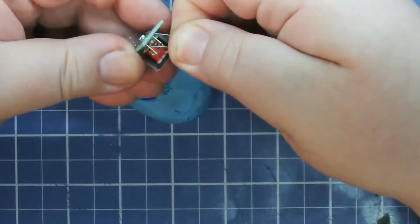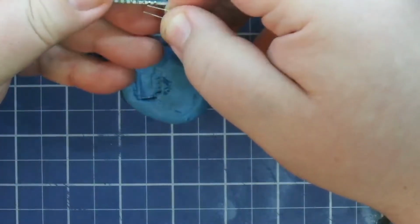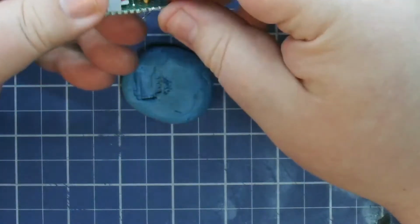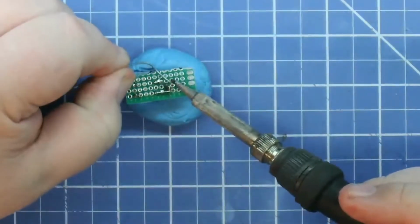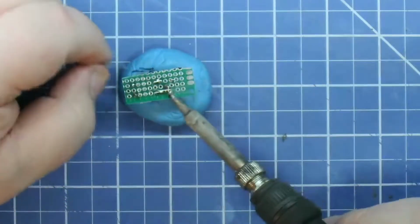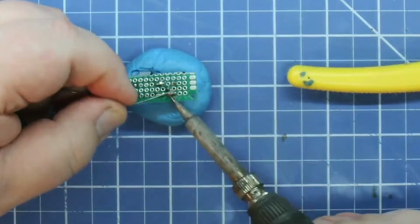And so here's the capacitor. And the capacitor is only there for blocking that phantom voltage. ICOM's the only one that does it. You can use this exact same circuit pretty much on any radio. You can actually include that capacitor, and it's not going to hurt anything. In fact, I have a Yaesu radio that doesn't do that, but since I was testing this out for my friend that has the 7300, I went ahead and left it in there to see if it hurt the audio at all. And it doesn't hurt the audio at all.